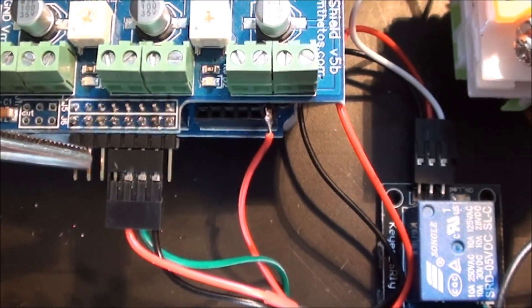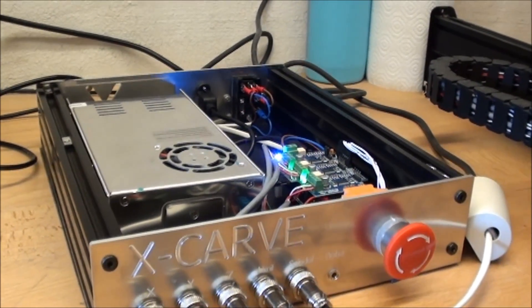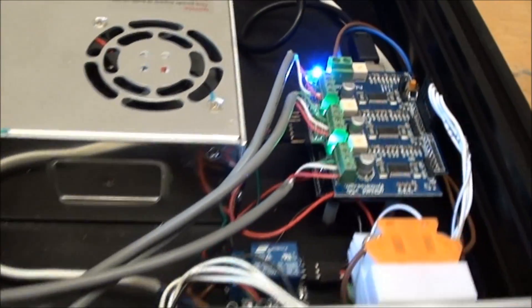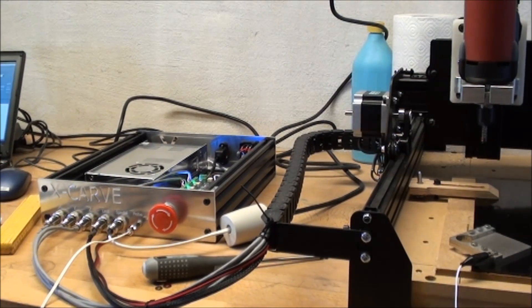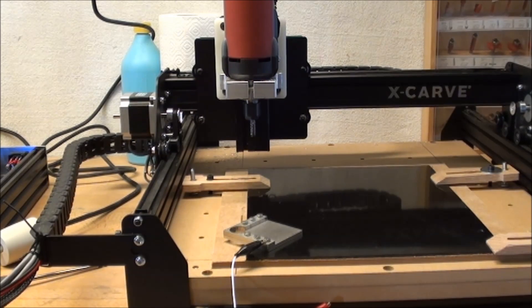So it's much smarter to put it underneath and use an angled one. Now I have soldered on all the connectors, connected them, and powered up — and no smoke came off, so that's good. So the next step is of course to check that the spindle relay, the probing, and the motors are all running as they should. Let's just start to see if it will move — okay, all that works. Let me do a homing to see if the limit switches are okay.